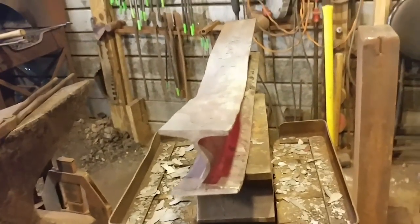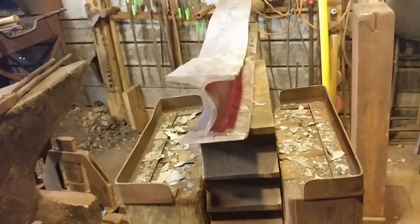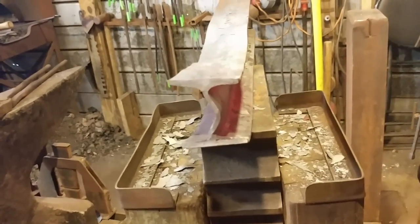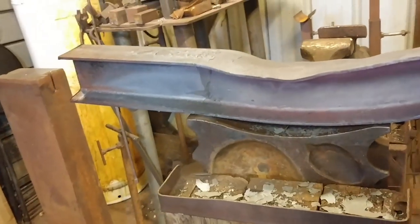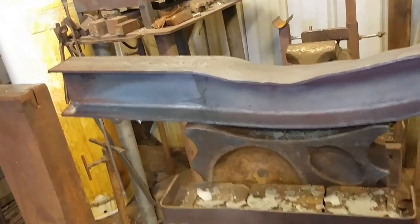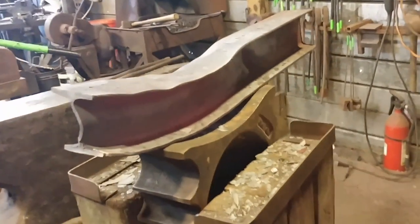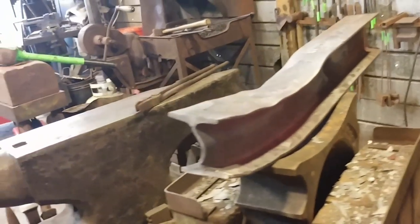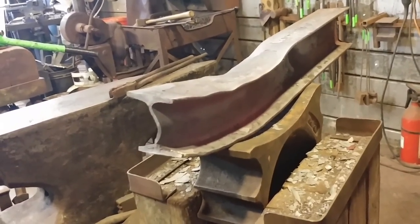So obviously the top and bottom is like bending a piece of bar the flat way or the easy way. And then the middle portion is like trying to bend a bar the hard way, which, as these I-beams are extruded out through a bunch of heat and pressure through a bunch of rollers, I'm pretty sure this is designed in to keep these things from buckling and just collapsing a great big giant building. That's why we still use them to this day.